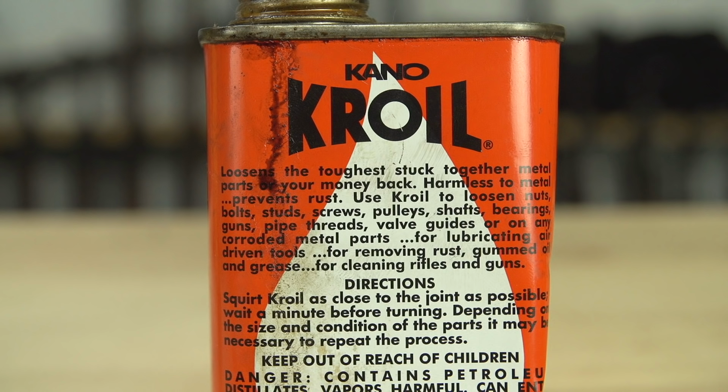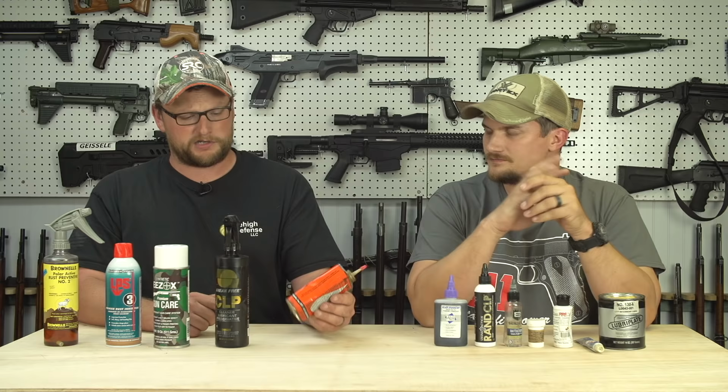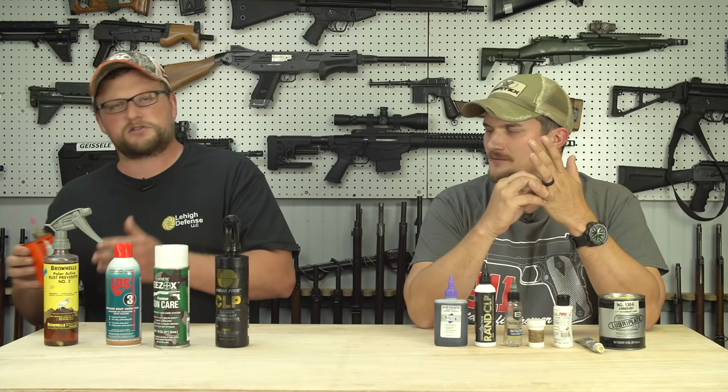Yeah, I pretty much mirror everything that Chad said. Primarily where I find use with Kroil, I always keep a can of this stuff laying around. A little goes a long way. You can tell by the condition of this can that we've had it a while. Kroil is excellent for getting stuck screws loose. When I'm cleaning up an old gun and there's a stubborn screw that's not wanting to move because it's got a pound of yak grease under it or something, I take a torch and heat it up a little bit, drop some Kroil on there, it creeps in, and it will unstick any screw you can possibly think of. Another thing I've used Kroil for quite a bit lately is getting my monocore suppressors unstuck from the tube.